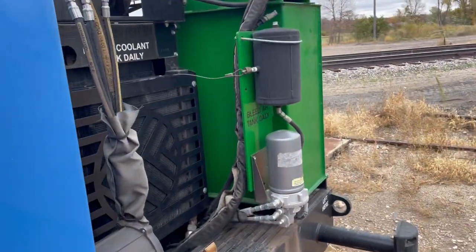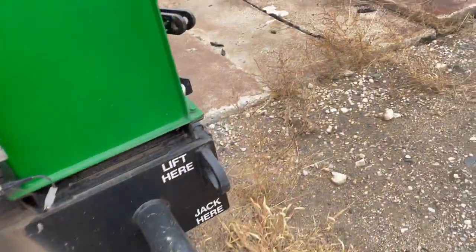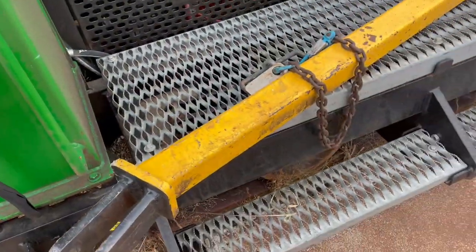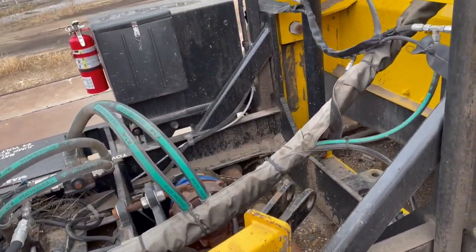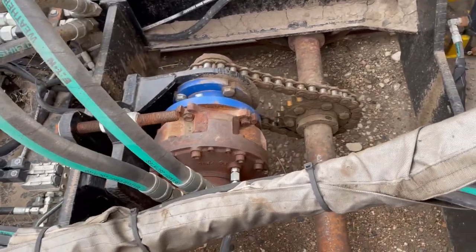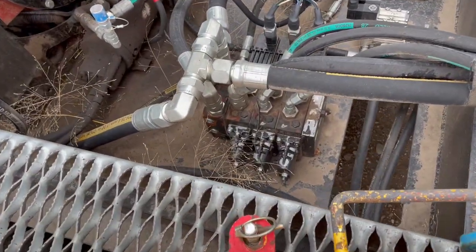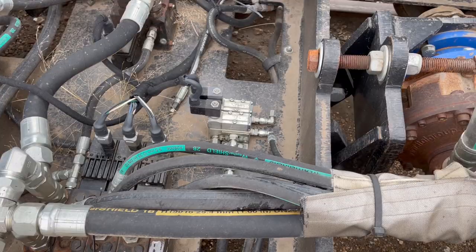Little hydraulic tank, fuel tank. On this side you have an extra set of controls with a horn and an e-stop, and a tow bar because that's how you move it around — you just tow it because it doesn't propel itself very quickly. It's got a little propel motor, chain driven, one drive axle, one valve bank — or technically two — one pneumatic valve bank.